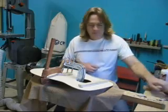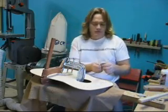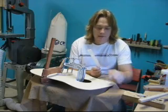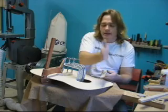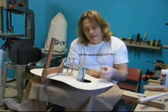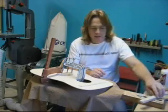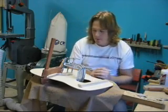Now while that's drying, the next piece we're going to put on is the upper transverse graft. It's a flat piece made out of scrap from what we cut off from the edges of the soundboard, so the grain runs along this way and is up and down. It's an eighth of an inch thick. You take it from the scrap you cut off from the edge of the soundboard, fashion that, and again you need a caul to go on top of it to clamp it.